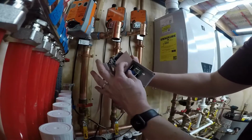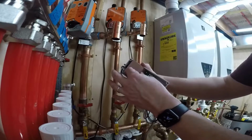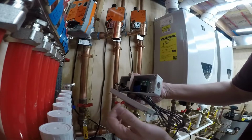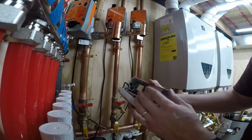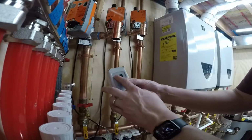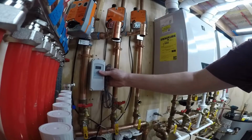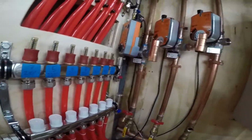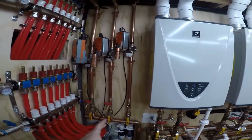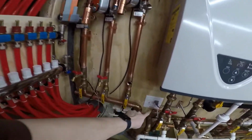These contacts up here are where you connect the power. So I could just wire nut off the power wires before they go to the aquastat, or even just get 2 wires in there and screw them down and just do it all right within this box. And then I would have 1 wire coming out from the aquastat. And that's where I'm thinking maybe I get tray cable that has, I don't know how many strands in it, because I would want 1 that's bringing power in all the time as long as the switch is on.